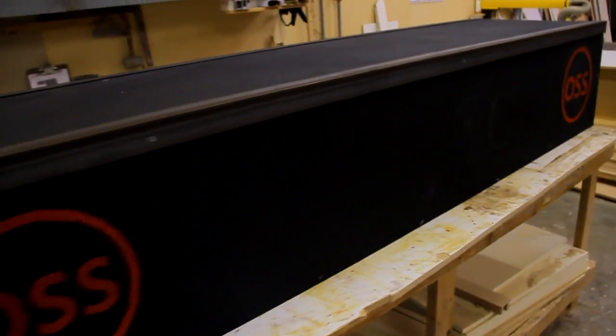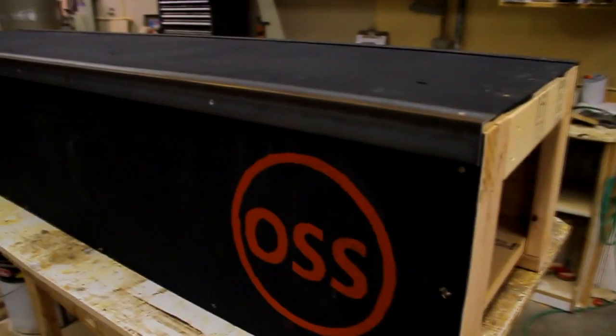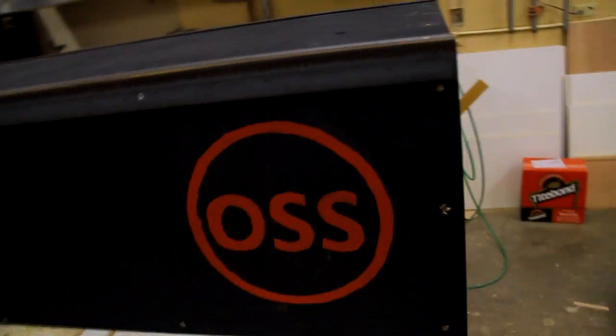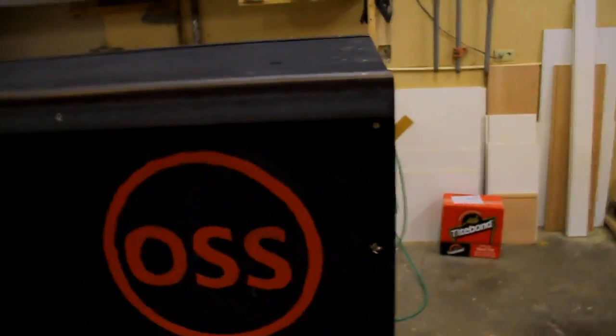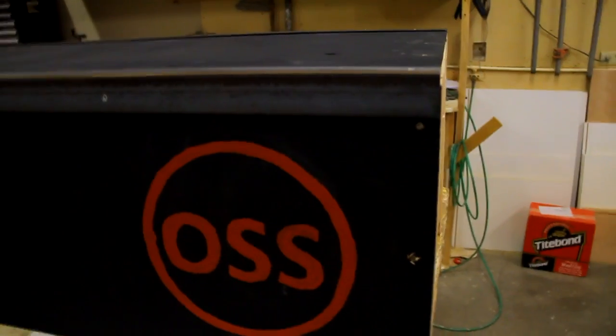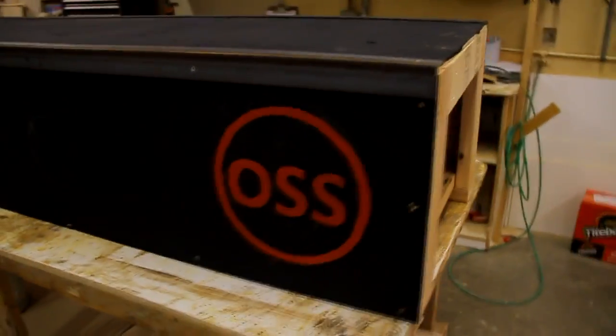So then you're just going to want to screw on your sides and your top. And then once those are put on, you'll want to put the angle iron on. And then with the angle iron, you're going to want a bit that is bigger than the head of your screw, just a little bit bigger, and then you're going to want a bit that is a little bit bigger than the threaded part of your screw. And what you're going to do is drill all the way down through with the smaller bit, and then drill about halfway down with the bigger bit, and that'll make your screws sit just under the angle iron. Sorry, I can't really get focused here, but it'll get your screws to sit just under the angle iron, which obviously you don't want them sticking out for grinding.